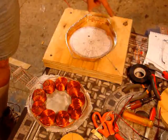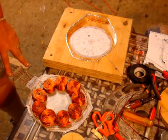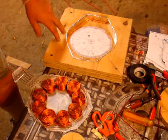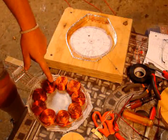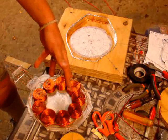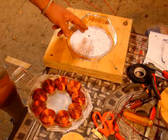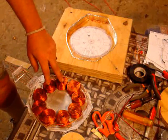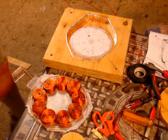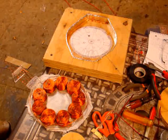There will be two more down here. I made them all in basically two tabs. I'm taking my wires out because I'm going to design the block later — I'm just here for testing; this is a prototype. This is going to go from star, which is twice the voltage and just the amperage of what the coil itself can do, and then it will go to star series, then switched over to delta where it puts three coils and three more coils. You always have two phases generating — those can be put in series, which is star, or into parallel, which gives you twice the amps at regular voltage. It'll switch over to delta at higher speeds. Two strands of 18 gauge is almost like 14 gauge, so we ought to be able to get decent wattage out without the stator overheating — that's what I'm looking for. It's going to be a pretty neat unit.